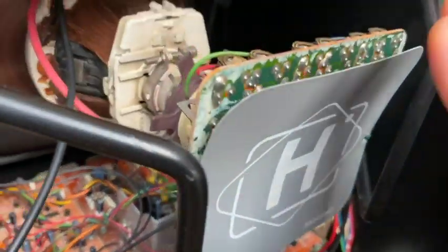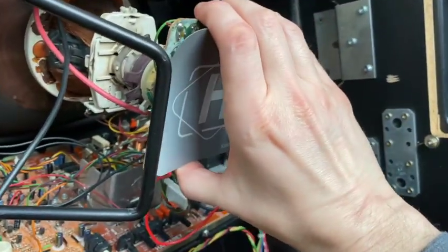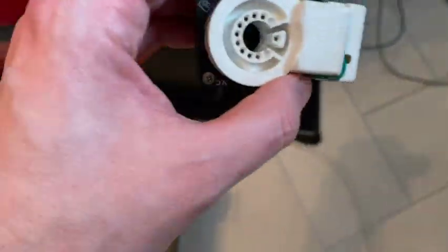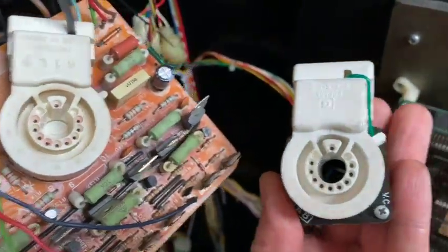So this is a little disclaimer. Please make sure you know what you're doing. There are certainly several videos on how to discharge a CRT tube on the web, which are worth looking at before doing so for the first time. If it's done right, you will probably see a little spark or hear a little clicking sound when you are discharging the monitor. We are also disconnecting the neck board from the CRT tube, and those are the two points that the rejuvenation device, which we will be using, is going to be connected to. So it will be connected to the anode cap, and also through the CRT neck.